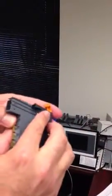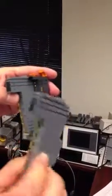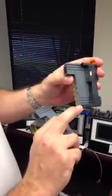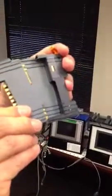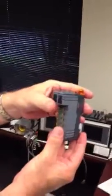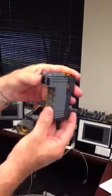It's locked together. Then you take the slice that I send you that plugs into this base. Again, it has a keyway at the very bottom that it goes in this male slot here. So you line that up at the bottom and just slide it forward and snap it in. So that's installed. Lock this down so it's attached to the DIN rail now.